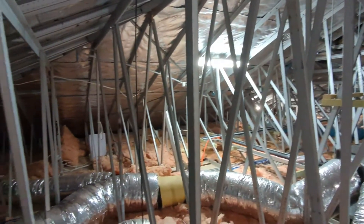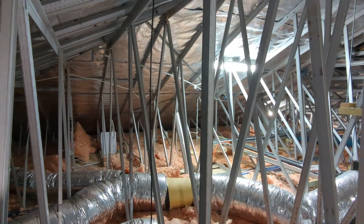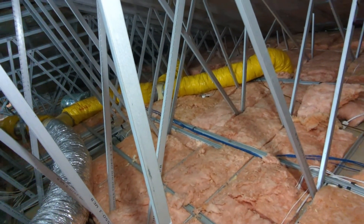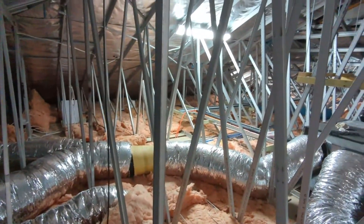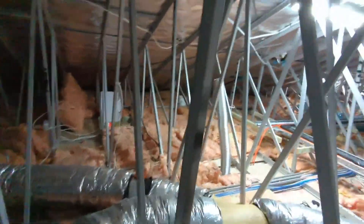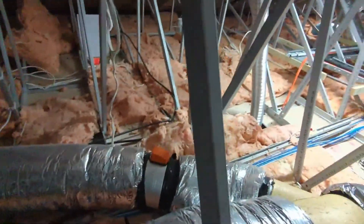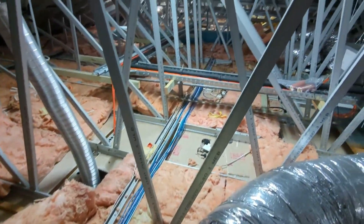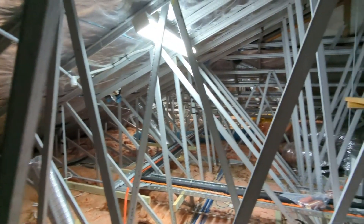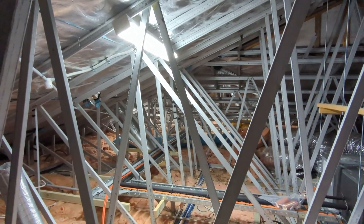I think that's a wrap for this episode. Next episode we're going to run some catenary wires so we can redo all our network cabling. The existing network cabling is actually run reasonably well — generally run along battens — but since I've got to relocate it all out into the garage anyway, I may as well run some catenary wires and just make it a little bit better. You can see it's run along the floor, all bundled together, but the plan will be to run it further out towards the edge on a catenary — just to tidy it all up. See you next time.